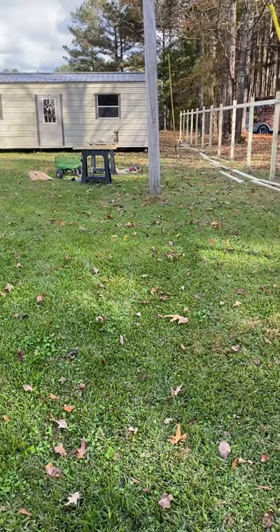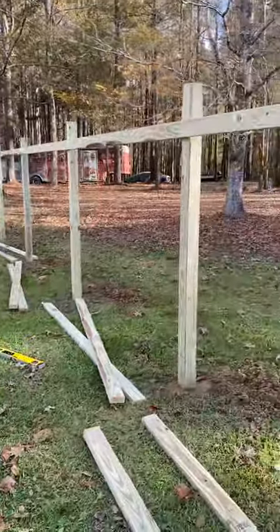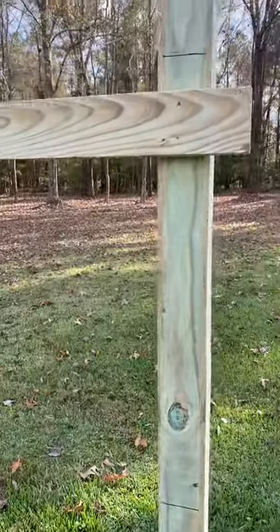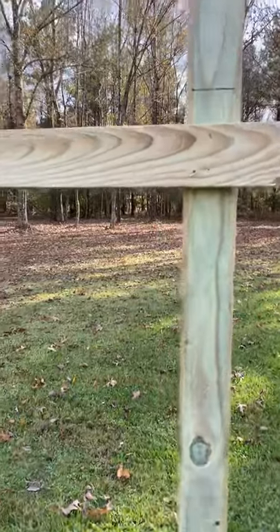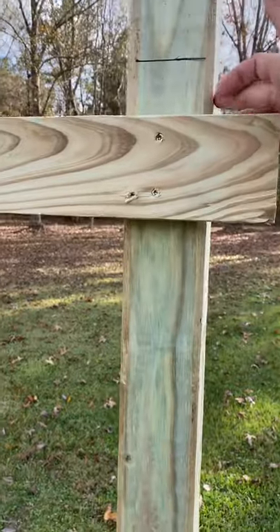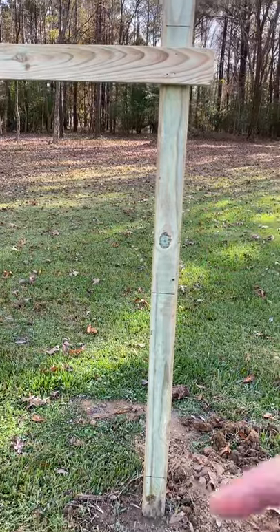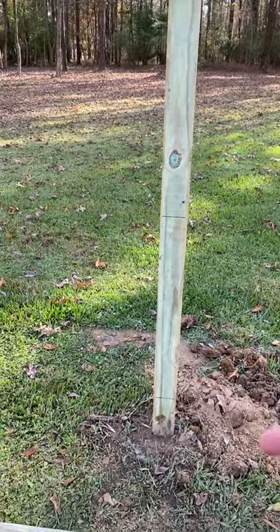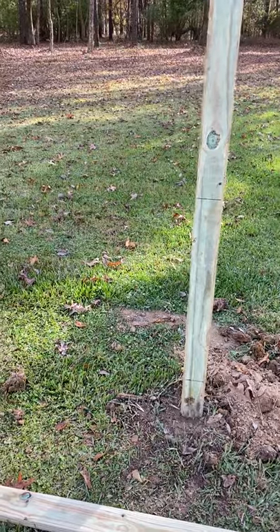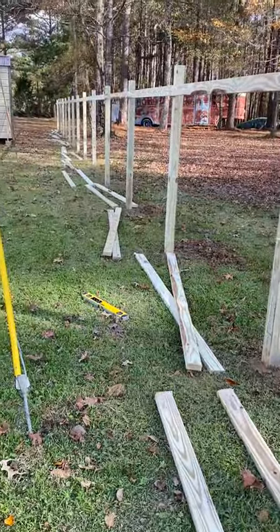On the spacing part, what I do — as you can see — 66 inches is going to be right here. I had to make a little bit of adjustment, drop this down. I'll mark from the top of that runner down 28 inches for my second line, and then down to 56. So basically it's 28 and 56 all the way down on every single runner. That's going to leave me a perfectly even space between every two-by-four in every single section.